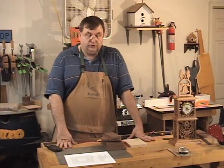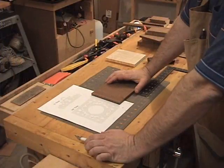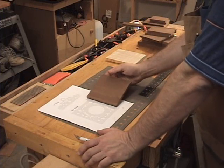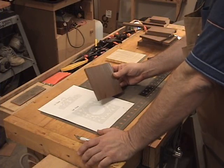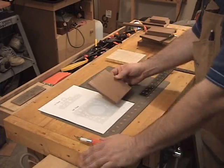What I'm going to do now is go ahead and cut out the pattern, apply it to the wood, and then I'll meet you over at the drill press. When I'm building a project where I want all the pieces to fit really well, I cut them out on the table saw to the exact size, because in this case we're basically making a small box and we want all the edges to be nice and flat.